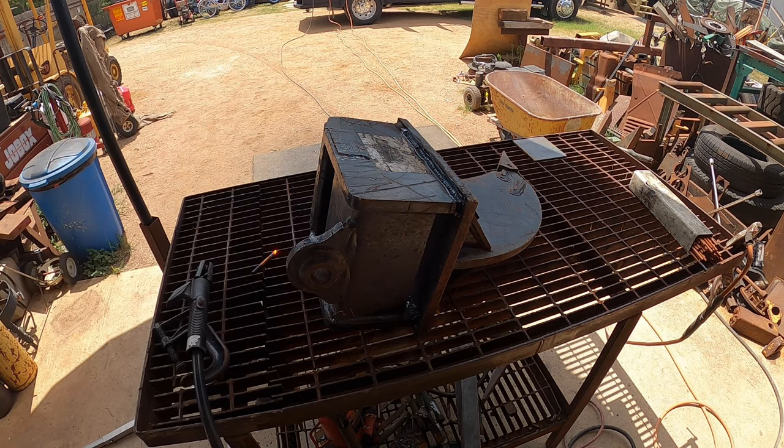Normally it helps to start the arc when it's nice and red, and sometimes you can just ground it on the material until it starts glowing, then it's easier to start, almost like scratch starting. So now that it's cold, I can get it hot like this. See, just like that, let it get hot, now it's ready to go.